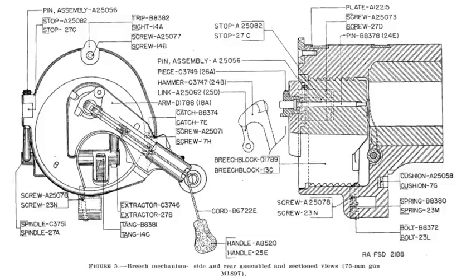This was still a single-shot gun, but in addition to the recoil system, it had what's called an eccentric screw breech, which was really quick to operate. You have a round barrel with a rotating breech block that has a hole — when closed, the holes don't line up and the breech is sealed; rotate it open and they align for loading. In practice you pull a handle up, the empty case is automatically ejected, you slam a new cartridge in, close the handle, and the gun is ready to fire again. You don't have to relay it or re-aim it — just throw a new shell in and pull the lanyard.